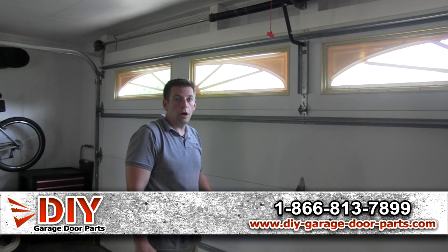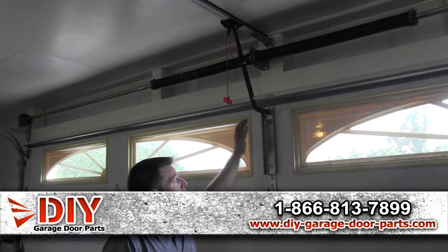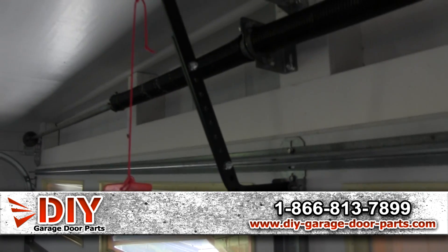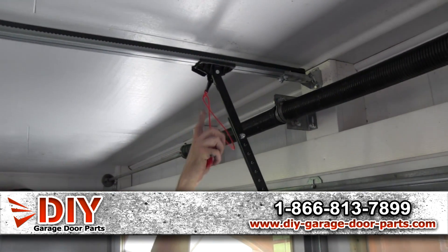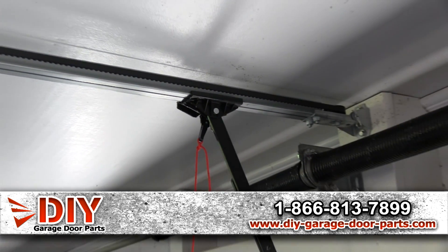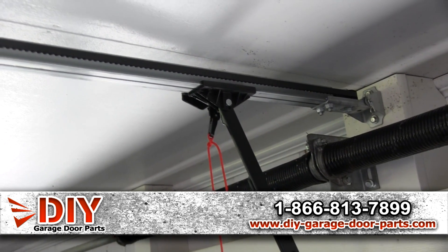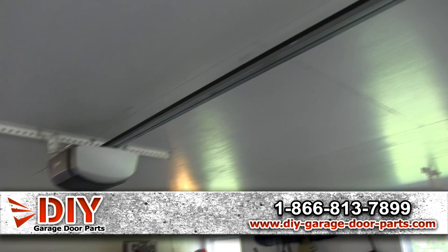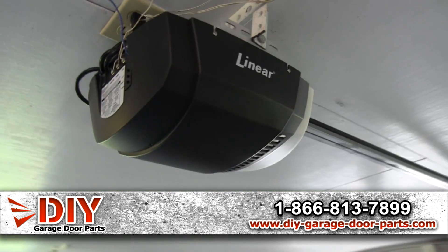As far as your opener goes — there are so many different models, but here's a general overview. You're going to have an arm that attaches to either your operator bracket or a smaller operator attachment that comes with most openers. Then you have your emergency disconnect, which attaches to your opener trolley or carriage so you can disengage and raise the door manually. Then you have your opener rail, which is made out of steel or aluminum. This particular opener has a belt drive, which gives you quieter performance over a chain drive or screw drive. Back here you've got your motor head, light covers, light bulb, and on the back side is usually where your circuit board is.